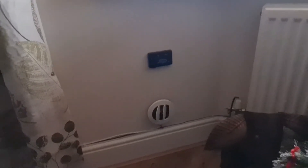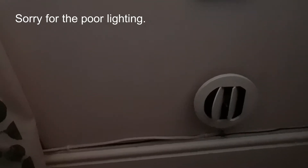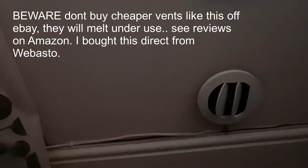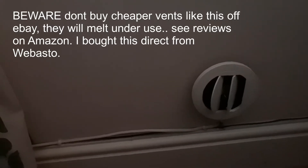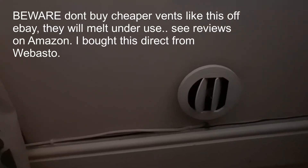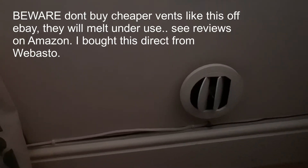Here we are in my lounge. As you can see, the heater's controller is situated there. I had to buy one of these vents — they come with doors that you can close, and you will need one if you're installing one of these systems. Because you will get a draft coming from the machine outside, especially if you're drawing fresh air in from outside as I am. Invest in one of these closeable vents to prevent the draft.